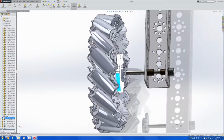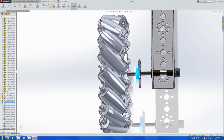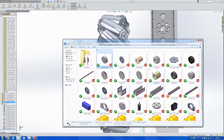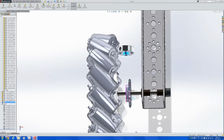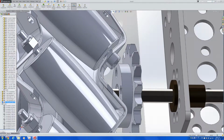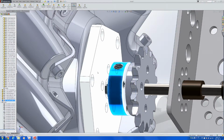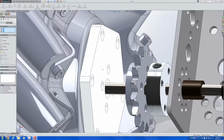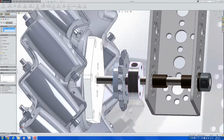And to put something else in there, let's get rid of the coincident mate between the two parts. I have a feeling that an axle shaft would be a perfect fit here because it has tapped holes, it's a good spacer, and also usually axles get through. If you want to use the axles like this, it is advisable to get a drill that's around the similar size as the axle, and drill a hole through the center hole so that you can use it as an axle holder, but when you need it to, the axle can just rotate freely inside the axle holder.